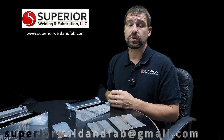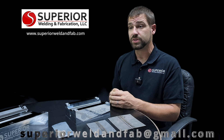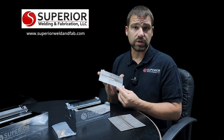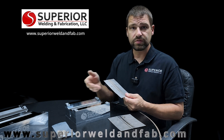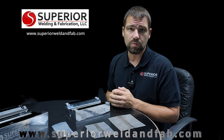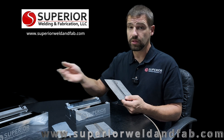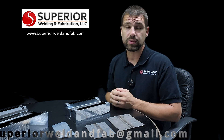It also works for your other certifications — D1.6 for stainless steel or sheet metal certifications. So it's not limited to D17.1 or aerospace. For example, if you wanted to do a structural certification in TIG on 0.060, you could use this fixture to take your D1.6 weld test and submit it for bend tests. For D17.1 titanium — commonly used in aerospace — this fixture or the large fixture allows you to take that test with the repeatability you'd want between each employee.